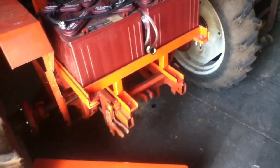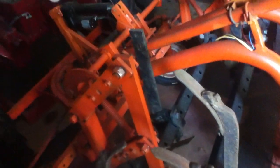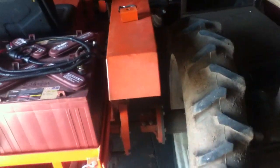It's a high quality reducer. And that's it. This is a wonderful little tractor. On this one, there's no 3-point in the back, but we have this wonderful heavy-duty toolbar in the front, which is very visible, even more so than the Cubs. It's a really nice tractor. We've also made spacers so that we can set our tires at 60 inches. So we got 5-foot center to center beds, and the spacers do that, extending it beyond what the original TuffBilt model had.